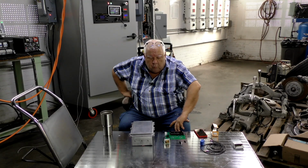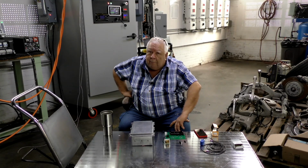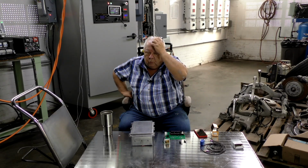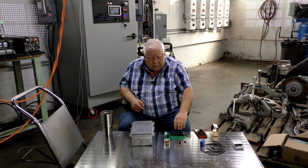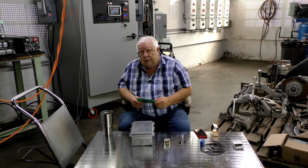We can simply have them work automatically based on power levels, but we don't want to be taking it out of one battery, running it through a grid inverter, and back in through our Sigenergy inverter into another battery. What's that about? We need to be able to switch those on and off based on our knowledge of the output power of the PowerSafe. And that, by the way, is exactly the same situation as a peak shaver would need to do with the amount of power coming out of the grid and the wall.